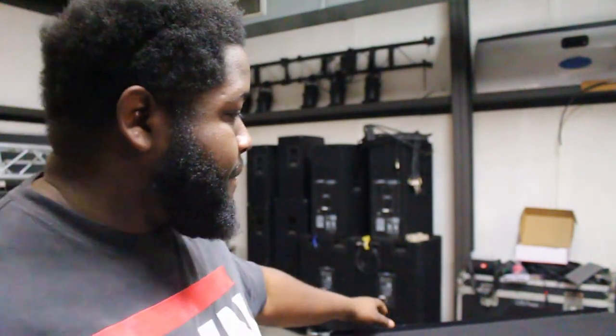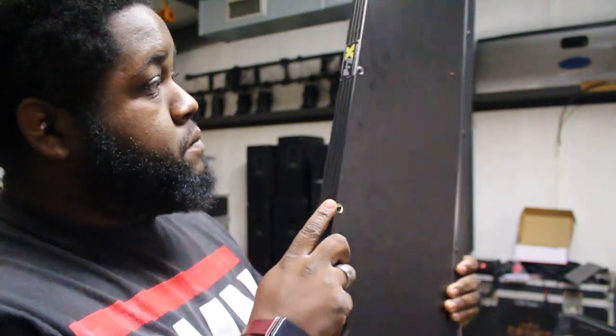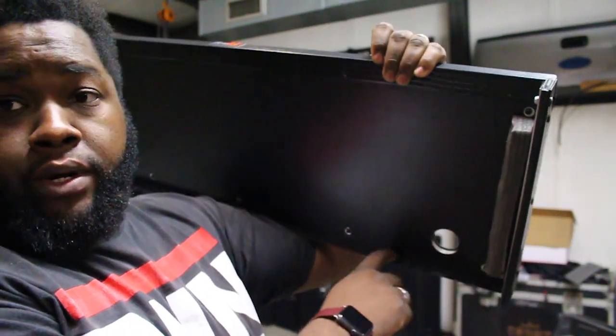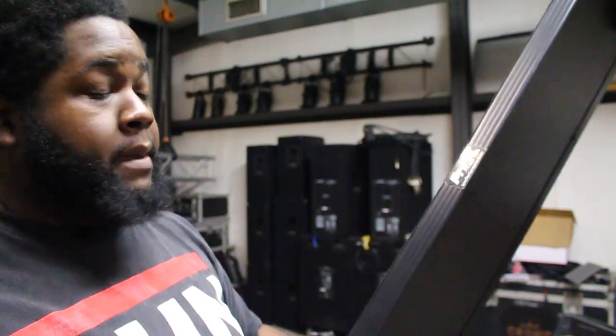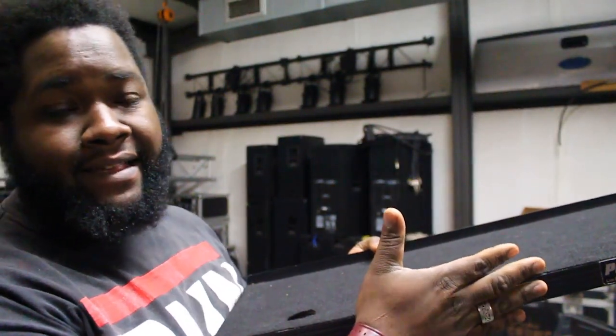Now, you could stop there and have the antennas hang out in the bottom of the case. That would be okay. But the best placement for the antennas is up out of the way and have line of sight. That's always the best application. So what I'm going to do is mount it to the back of the tray. There's plenty of room for me to drill a hole so I can place my pass-throughs in. And then my antennas will live on the back of this case here.